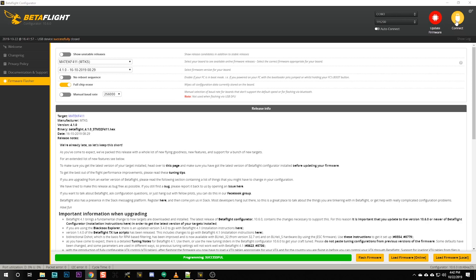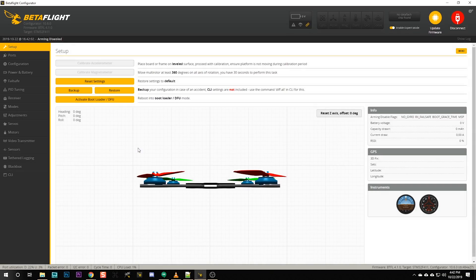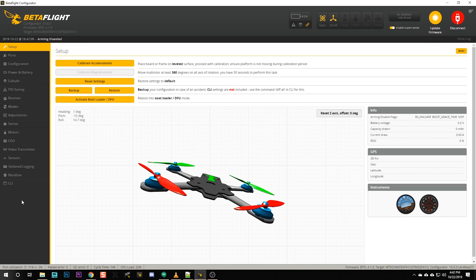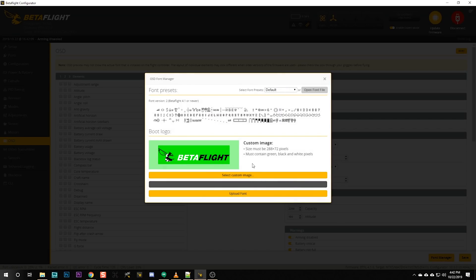When that's done, we should see the COM port reappear and connect. In Betaflight 4.1 it will ask us a question — just hit 'Apply Custom Defaults.' That's just a hoop you've got to jump through. The other hoop: the first time you update a flight controller to Betaflight 4.1, you need to go to the font manager and re-upload the fonts. To do that you need the battery plugged in, or the OSD chip won't actually update. So I'm going to plug in — props are off — and upload the font.